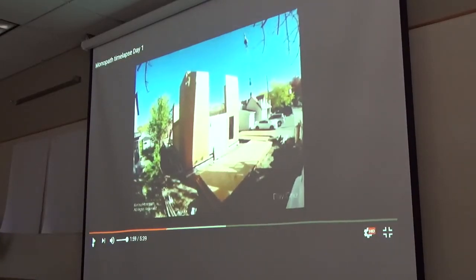Once the interior walls are stood, then we can just start laying out the floor trusses, and we've got basically the same floor truss layout where you've got all the common length, the full length ones, and then the two that flank the stairway are going to carry to the LVL. We'll run our shorts, we'll brace up the LVL on either side, and we'll put temporary framing across the opening, and then we'll start craning in or flying the subfloor panels for that second floor.